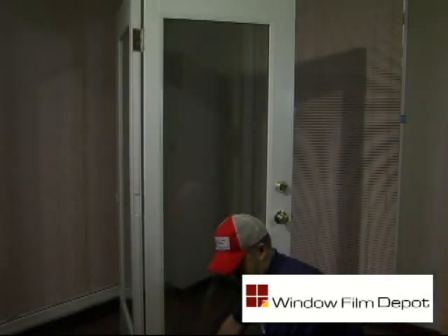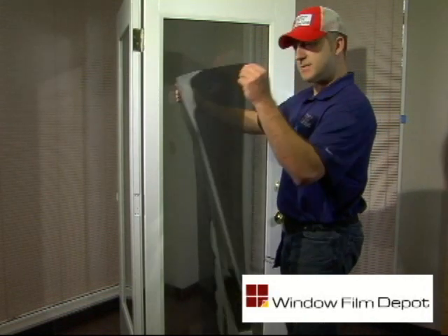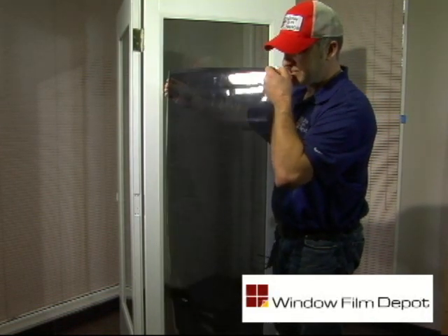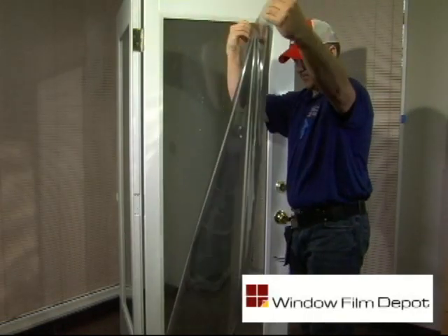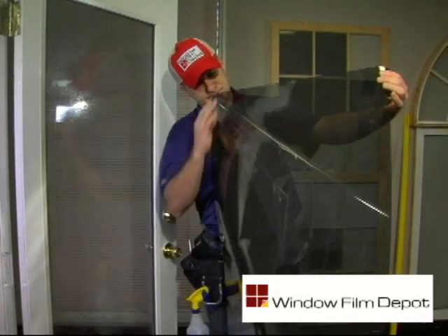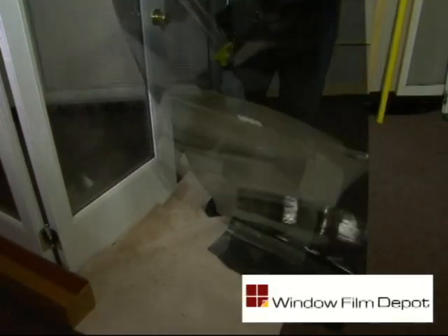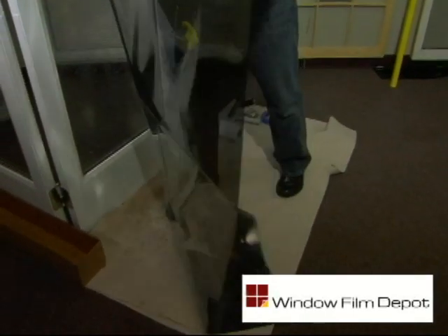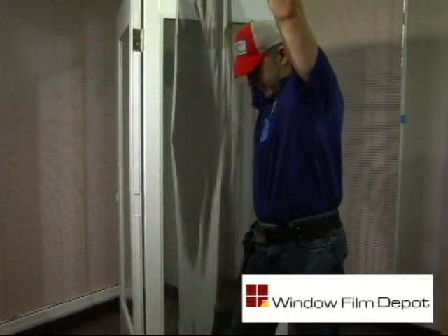Once the liner is located, unroll the film gently towards the floor to avoid kinking. With one arm extended, pull tightly onto the far corner of your film. The near corner should be pinched between your teeth. Pull the liner down and away from the film towards one side. Once the liner is partially removed, step on the exposed liner and walk the liner off.